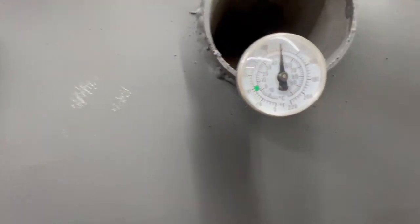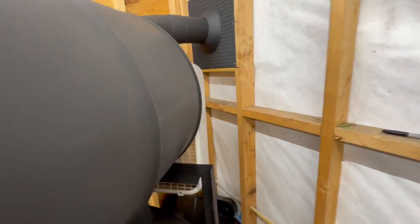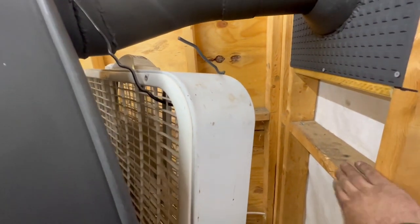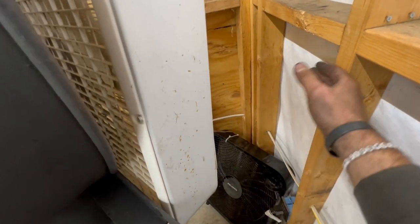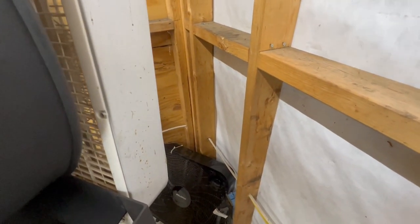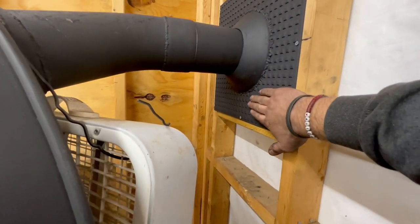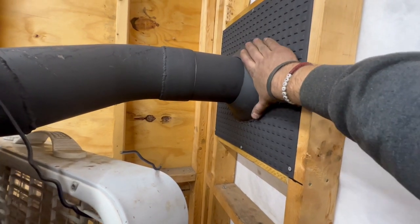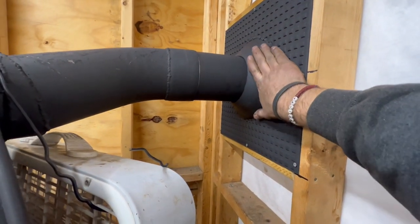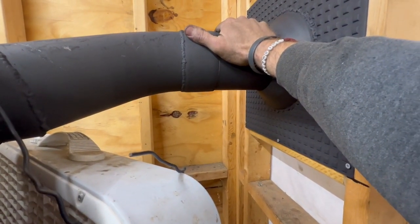We're all fired up. We're hitting about 120 degrees in the center heat exchanger tube. I need to build an enclosure back here to force air through the tubes more efficiently. It's been going about an hour and I put both fans on right away. I wanted to check how the wall felt — the thimble is completely ice cold, the area around it is just room temperature, and the stovepipe itself is warm but I can keep my hand on it.